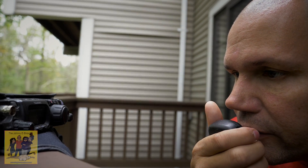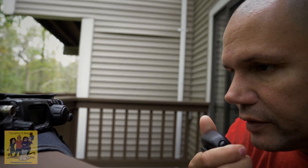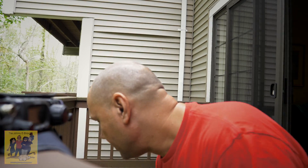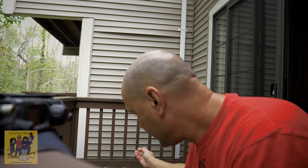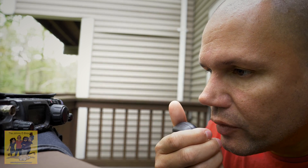Let me check my SWR. That's the other thing I don't like — you do have to screw with this cable, so my SWR is a little high. Let me shorten the cable up. KE0LCS — that's a little better. I just bundled up the wire a little closer. KE0 — that made it worse. KE0LCS — that's three notches. He's not hearing me anyway, so that's why I'm not worried about interrupting. My SWR now is perfect — this is what I had to do with the cable.